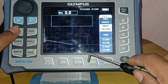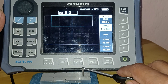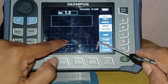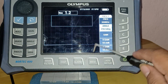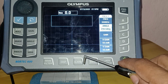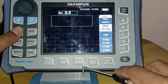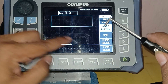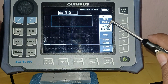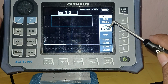I am doing it once again: pressing the null button, then lifting the probe. The graph should appear as a straight horizontal line. This is the proper calibration signal that should appear after lifting the probe from the surface standard. Pressing the null button — you will hear a beep — then lifting the probe, and the lift-off signal will move horizontally to the left side of the screen. This is the correct calibration signal you should get when setting up a surface crack standard.